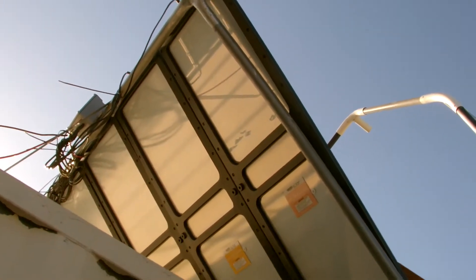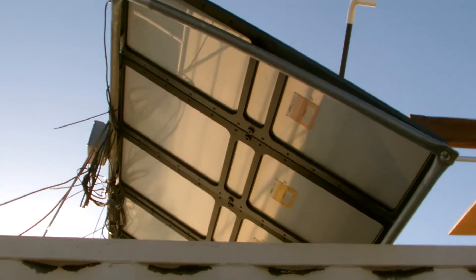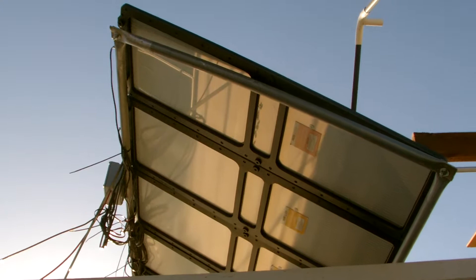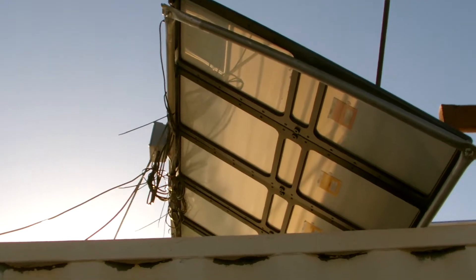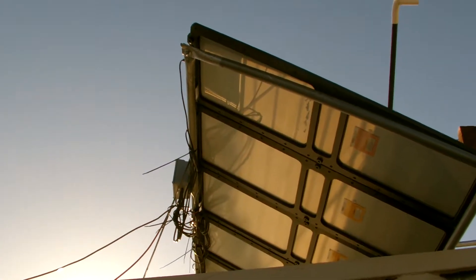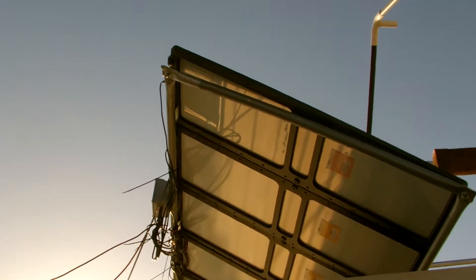After I got the nine panels on there, I started doing more research and figured out that you can only put two panels in series together for 24 volts when you use the QO breaker box — they're only rated at 48 volts DC. That would be pushing the limit when you hook up three panels together, because right now with two in series I'm already getting more than 33 volts going into my charge controller sometimes. I would definitely be pushing over 48 volts if I tried to string three of these together in series.